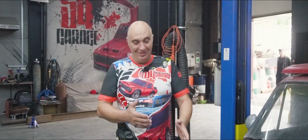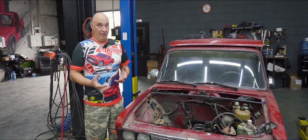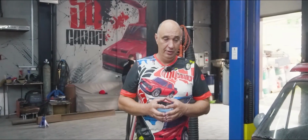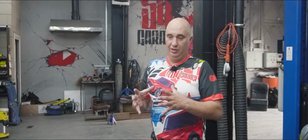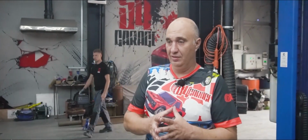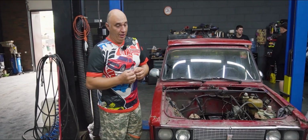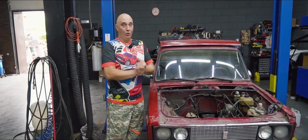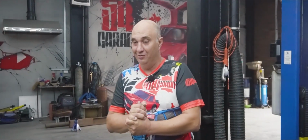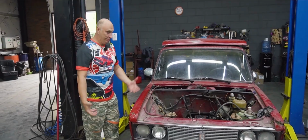Now, crankshafts, as we know, tend to be made out of iron. And iron is a material that is notoriously difficult to weld. The problem is that iron contains quite a lot of carbon. The number is somewhere around 0.75, if I'm not mistaken. That's the kind of metal that falls under the term iron, and different sorts do contain different amounts of carbon, but when you're attempting to weld, carbon is always a huge detriment. You get big pores, the weld overheats, and that in turn leads to a lot of negative consequences.